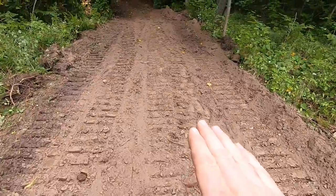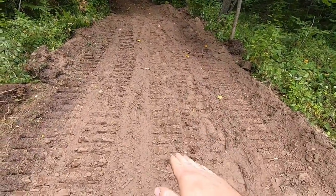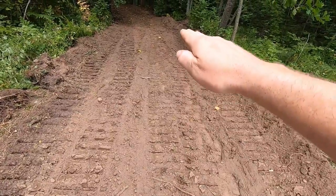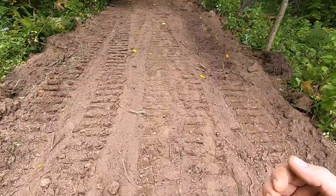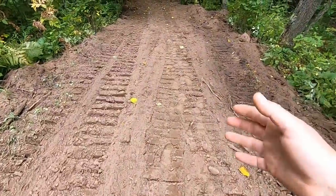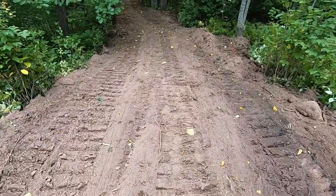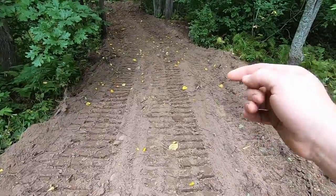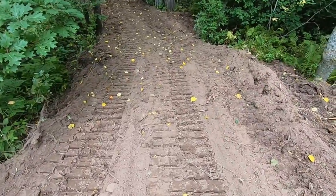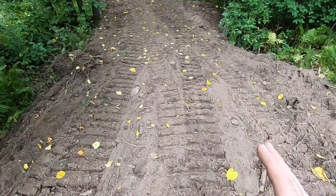And then when we get on the top, it starts dropping off. So basically, if I don't lower the blade again, it's gonna start leaving the ground and riding higher and higher. So I'll lower the blade. Again, just kind of monitoring the load that's on the engine, you know, how hard it's working, the sound of the tracks. If you run one of these machines long enough, where your posterior interfaces with the seat cushion is your main sensor, that and your ears. You're just always listening to and feeling how the machine is working.